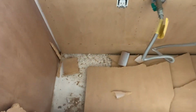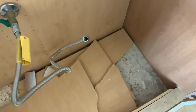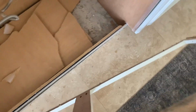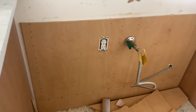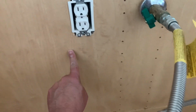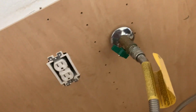All right, here's where I am. I just took a pry bar and started moving stuff and shaking stuff, and I took the side walls and folded those in, and this, here we go. There's the face frame gone, so now I'm just going to clean up, and I'll have to either cut or break the back around these two because I don't want to disturb these, so I may just set a circular saw really shallow and cut around these and then break it apart, or I might just try to break it into spots and snap it off.